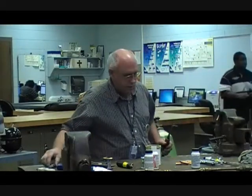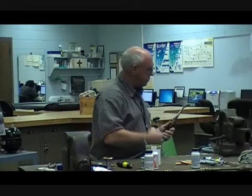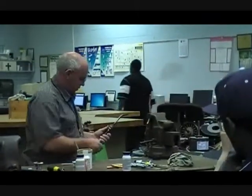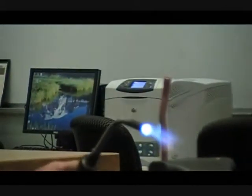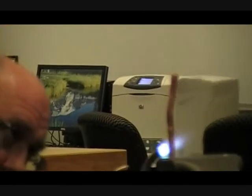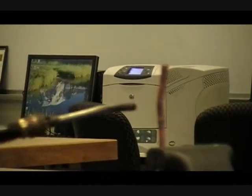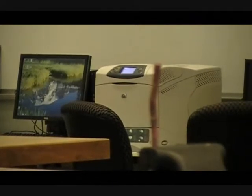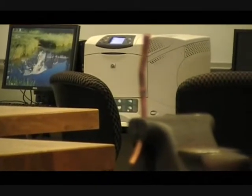This particular one — we'll go ahead and get going here. This is going to be a soft solder or a soldering process. I've already plugged the pipe. Did you notice I didn't let the flame melt it? I let the pipe melt it. Did you also notice that I didn't put it on but one side? That's because if it fits right, capillary action will take it all the way around.